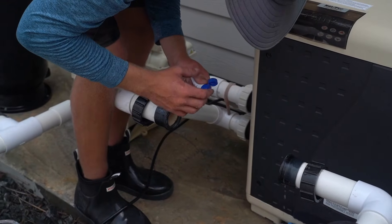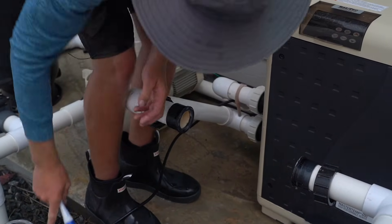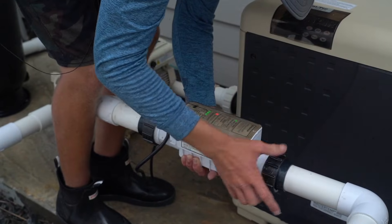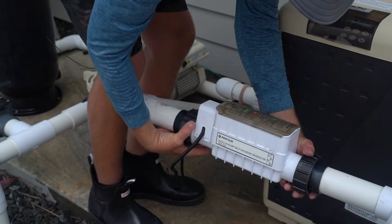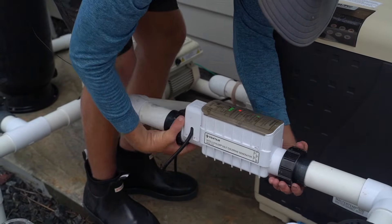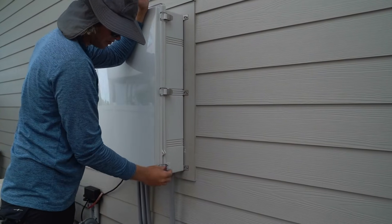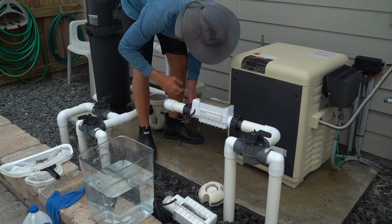We're going to apply another layer of lube on the o-rings. Then we get both unions just started — one on this side, one on the other — and tighten them at the same pace. We want to get the last turns at the same time to keep it even. Back off one a little bit to get them closer in sync, and now we're ready to turn it on. Check for leaks. These protective boxes are really nice — I would recommend them if you're anywhere near the beach. Put the velcro straps back on. It's not leaking anywhere, so we got all the leaks fixed.